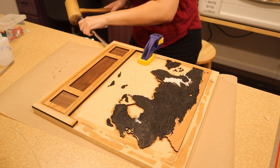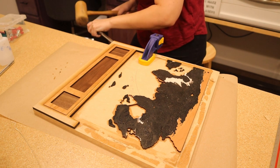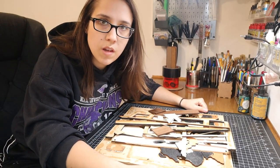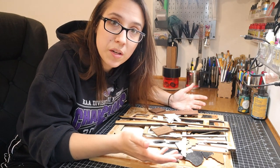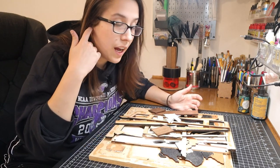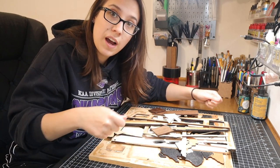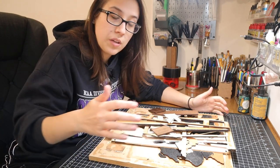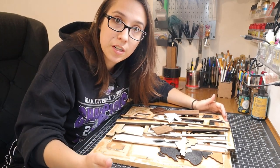It's at this point that I realized none of my pieces were aligned because the acrylic panel didn't fit, and I started trying to chisel away at the piece to save any pieces I could. I messed up enough that I'm going to restart everything. The biggest issue was alignment — I could not get the acrylic panel to sit nicely where it was supposed to. That's a mixture of how the frame was set up as well as how the land masses were inlaid. We're going to use a board that's not cut down to size yet and lay everything out basically in the middle, then use a router to clean it up later.